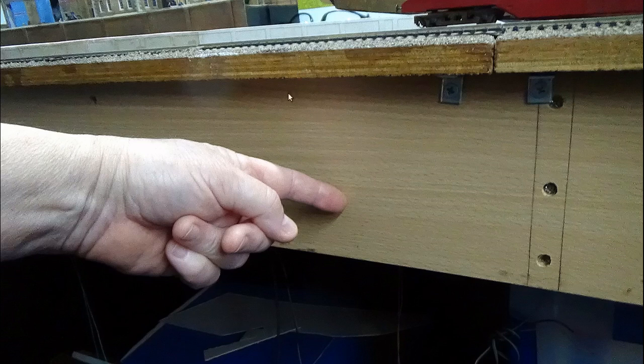This is the position where the eventual lever frame will go. I need to take a considerable amount of material out of this section — this bit at the bottom will only be 20mm thick, so I need to reinforce that. I've used a bit of 2x1 timber, just some rough timber, screwed and glued it in. Hopefully that'll support the frame properly.